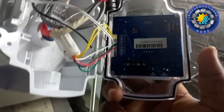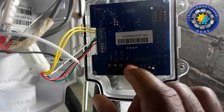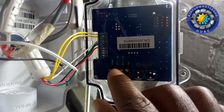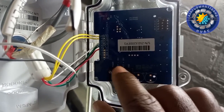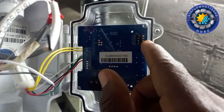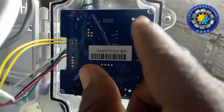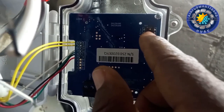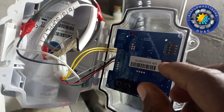So when we zoom in, we will be connecting our power supply here, the power, and then the ground. Then we'll connect the RNet minus and then plus cable here, and we have to make sure the network will be on the same port. We are keeping it on 1. We need to make sure it is the same on the controller so that there can be communication.